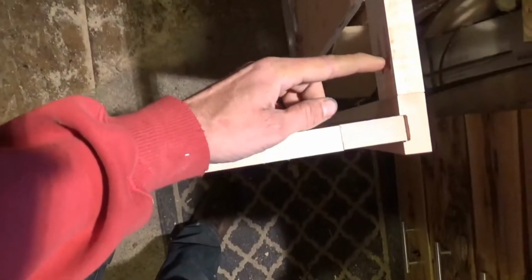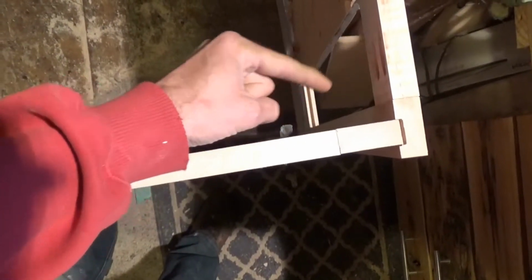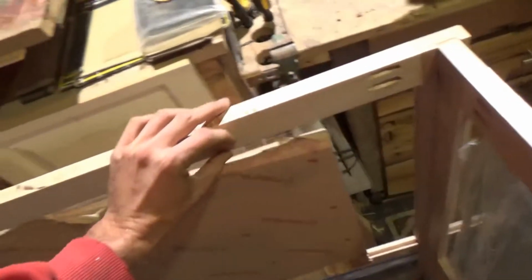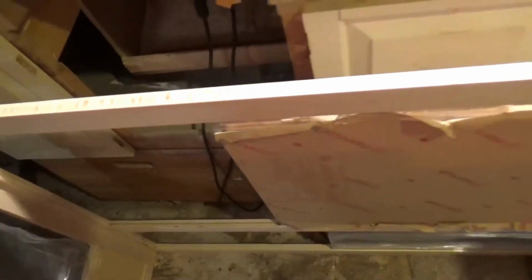sides, and at that point I'm going to come in with some right angle brackets, and they're going to be wooden triangles, and then I'm going to start figuring out the back slider on the front here. So I got the sliding door on the top and bottom to do. So pretty much at that point now where I just want to look at my design, and I'll probably actually start right up with the face frame and start doing my inner rail for the second slider doors.